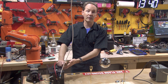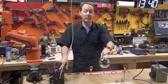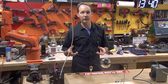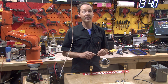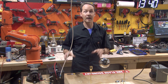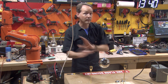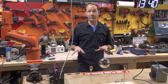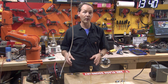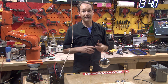This is actually working with a 12,000 volt neon sign transformer, so we're using 6,000 volts on one side, and that's plenty of power for this. I do not recommend doing this with a microwave oven transformer — the voltage is way low, the current is crazy high, and they're not designed to run for long periods at full output power. They get really hot. So get a neon sign transformer for this, or you could get small high voltage power supplies on Amazon or scrounge them from old laser printers.